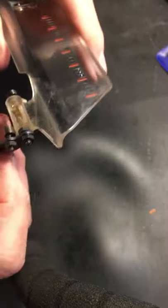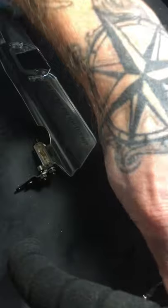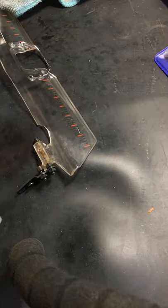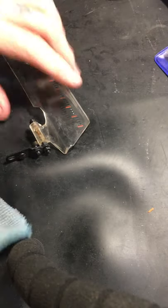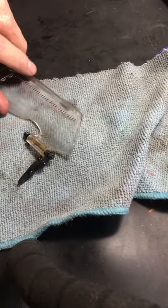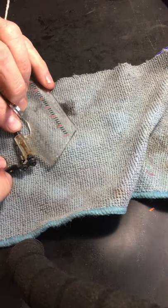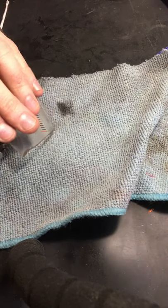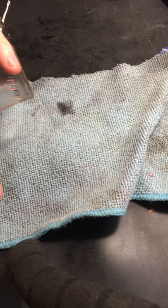So what we need to do first — these are gonna be 5.5mm, like most things in the typewriter world — five point five millimeters. This is a European standard; not very familiar with a lot of the American standard stuff. This thing is stuck, we need it to be able to move, so this needs to come undone. Let's get this jam nut unjamming — there we go.